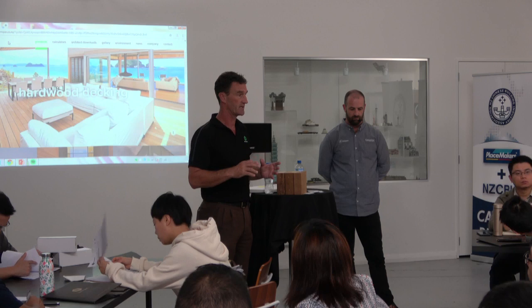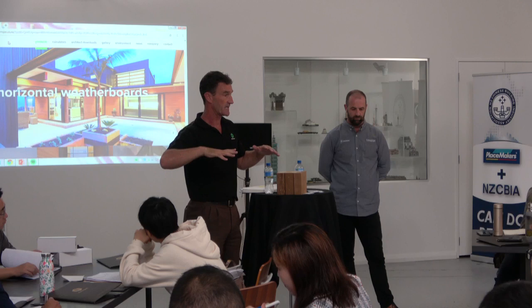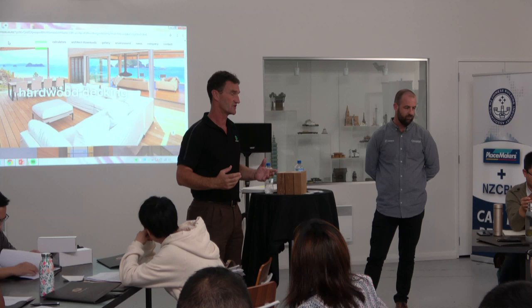And I've seen, again, I had a job in Devonport. The builder had three houses, and he'd done the top levels. He'd had a building inspector come through, have a look at everything, and sign it all off. He put the top level of cedar up on the three houses, and he started to come down the next level. He had another building inspector come out for a different reason. He saw the battens, realized they were the wrong ones, and said take it off, do it again. So he had three houses with the wrong battens on. He had a square top batten and a square bottom batten, and it's the wrong batten.